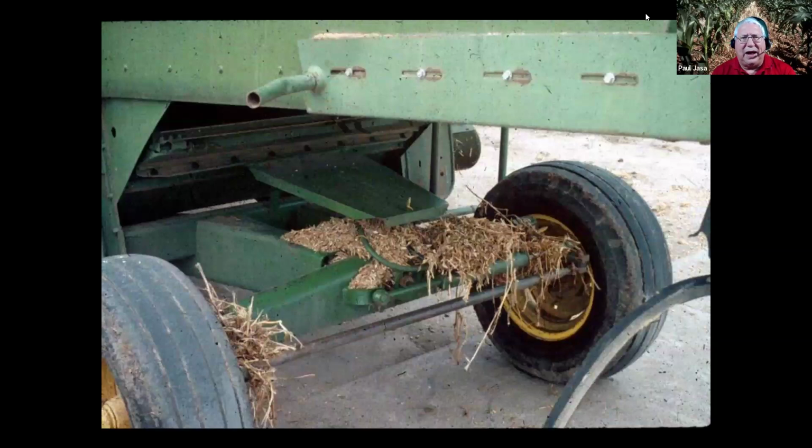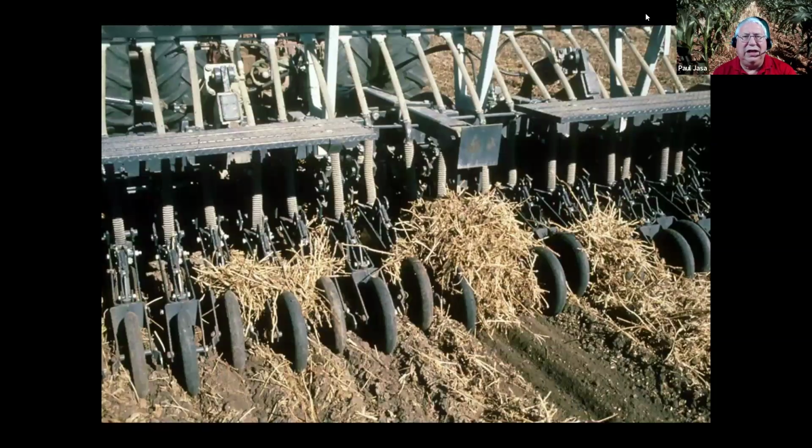And in the old combines, we had a bat spreader in back and had narrow heads. The bat spreader worked fairly well, getting the residue spread out. People didn't think too much of that little pile of residue there on the axle. I didn't think too much of it either when it fell off and plugged up the drill, the fertilizer bar, the planter, whatever. This is not a no-till drill problem. This is a residue handling problem.